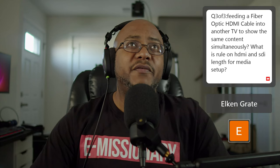All right, there we go. Matthew was saying to send two outputs, one for the program and preview and another for the program from the ATEM Mini Pro. No, you cannot. The only workaround with that is to have the HDMI out on the ATEM Mini Pro be your preview, your multi-view. And then the USB out is always going to send the program. You need to send that to something else like OBS, and that would give you the program. That's the only way you can get both of those at the same time with the ATEM Mini Pro.